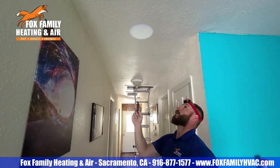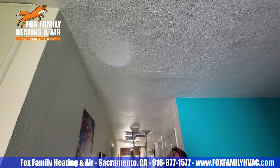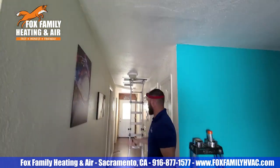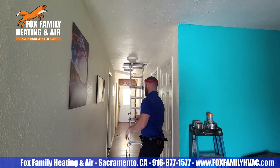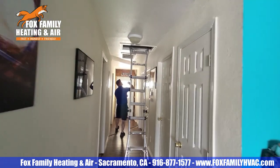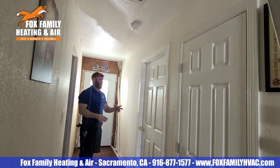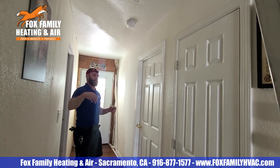So if I went up here, it'd be probably somewhere in that range. I'm just going to go that way, which is in view of the living room area, but it's still centralized — where if I have the front door open and the back window, it's going to pull evenly from all sides. Whereas if I went the other way, I'd have right about here, anywhere in this area, which if I had everything open, I would pull more heavy from this side and be a little lighter from places like the kitchen and the living room.